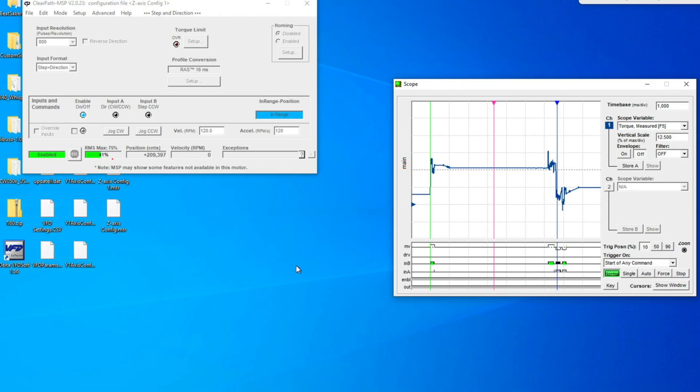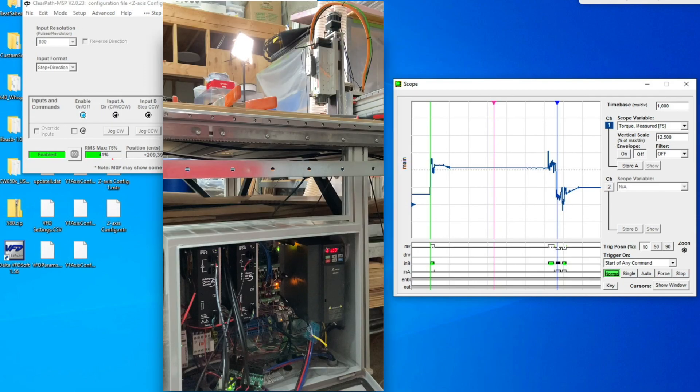While running tests on the Z-axis brake after I installed it, I noticed that the power supply driving the Z-axis servo would click every time the servo drove the spindle payload downward. In this video I've overlaid a view of the spindle motion and a view of the cabinet where you can hear the clicking happening, over the Windows software that shows current on the motor. You can see how, as it goes down, the current spikes depending on which way it's moving, and you can hear this click and see a little light come on in the power supply.